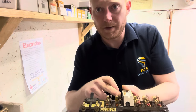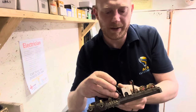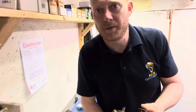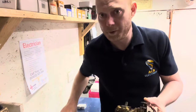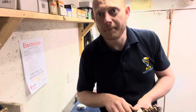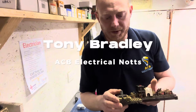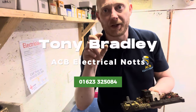Where it's all arced, that creates a carbon build-up. So rather than having clean brass and a really good connection, if there's a load of carbon built up it'll create a loose connection, which over time will generate a lot of heat — and again, in one of these style fuse boards made of timber, that's not an ideal thing. So yeah, whenever you're changing your fuses, make sure you switch the switch off before you push it in or pull it out.